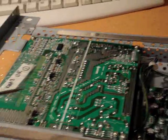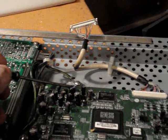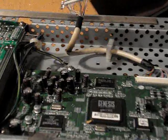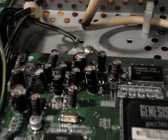Now you can flip that over to reveal the power board and the logic board. It's these two capacitors here — this one and this one — that we're going to replace. They're the ones that give you the problems. So again, this one and this one. They're both 470 microfarad, 16 volts, and we will replace them with 25 volt, 470 microfarad capacitors.